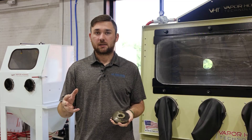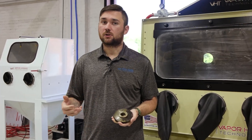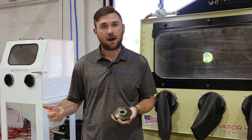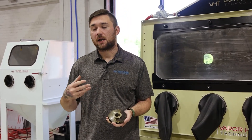The short answer is yes, if there is a lot of oil. What can happen with a dry blast process is that soda will clump, since there's no water to help wash away those oils, greases, or what have you on the part. It will clump all of the abrasive, make it ineffective, and just gunk up your machine. So it is necessary in that regard.